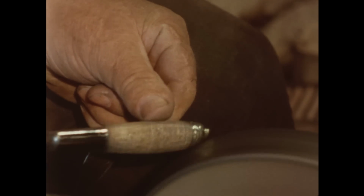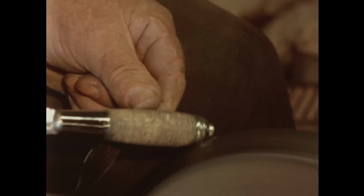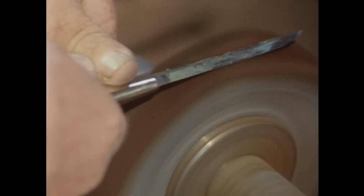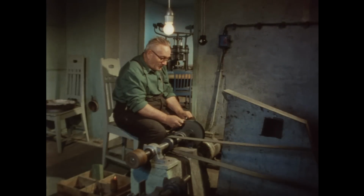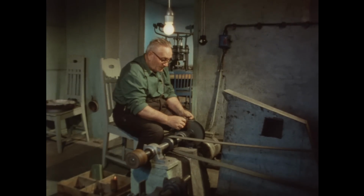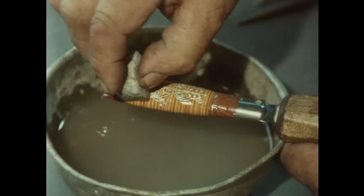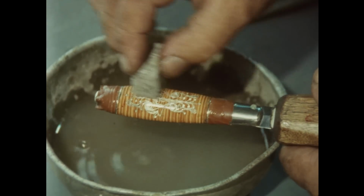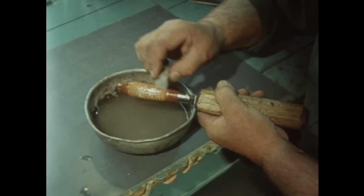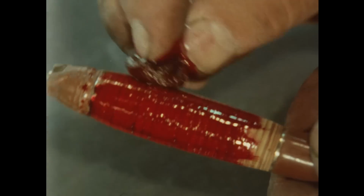When the blade decorations have been engraved, the blade is rubbed with a felt disc, and it is then finished. The fittings, too, get the finishing rubbing. After that, the lower fittings are engraved. Then the file marks on the bark handle are rubbed off with pumice stone. The metal figure is left just a little higher.